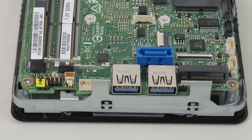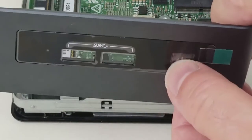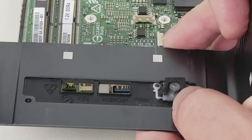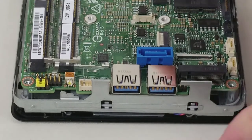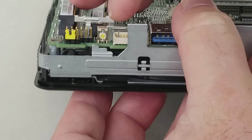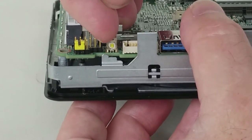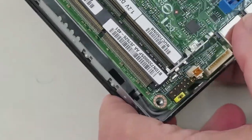One thing I do want to note is that the power button is a passive button with a light pipe — it's captured, so there's not actually a switch here. This is just a post with a light pipe for power indication. On the motherboard there's actually a micro-miniature power switch in the vertical position with an LED in front of it — that's the actual power button — and there is an LED there to light up the power indication.